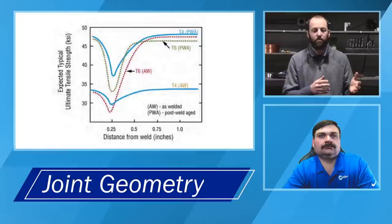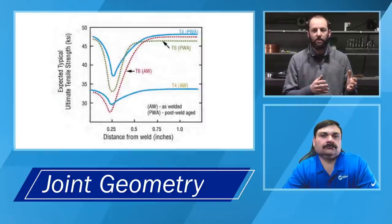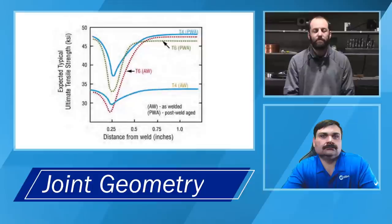If your stainless steel wire brush is for steel, keep it for steel. If it's for aluminum, keep it for aluminum. Don't go intermixing those. With the files, same thing. If you're going to be using it for prepping carbon steel pipe, don't be bringing that over to aluminum. But the actual file itself causing contamination of the material, the risk is quite low.